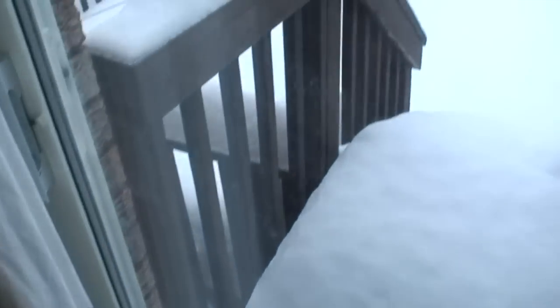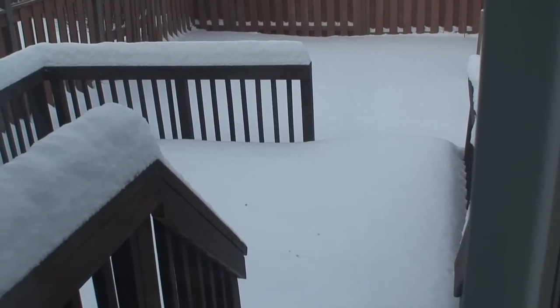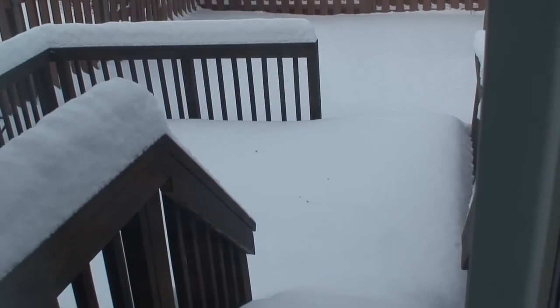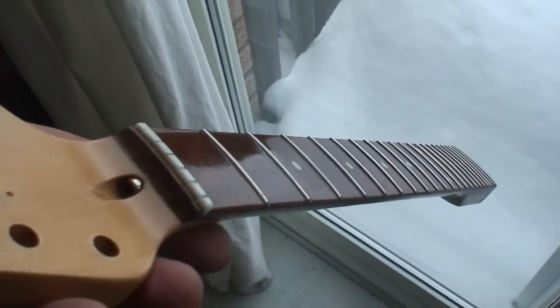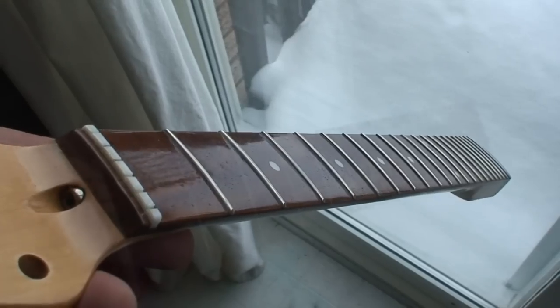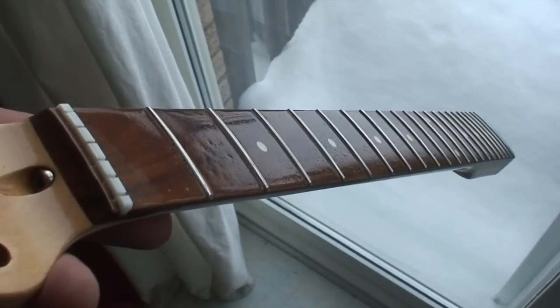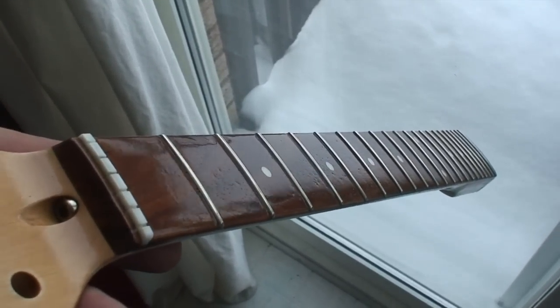The reason I'm standing out here is because it is so cold. You don't want to be doing finishing when it's this cold outside — it's snowing today, it's like minus 30, my garage is probably plus five. It's really cold. You don't want to be lacquering and finishing work when it's really cold. Here's the deal — I take this out into the garage, I lacquer it real quick. It's not an ideal condition; it should be nice and warm. I do heat up my lacquer — I warm it up in a warm bath of water and leave it there for 15 or 20 minutes.